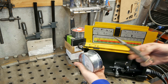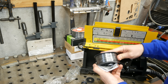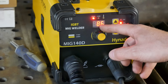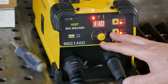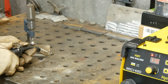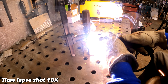First, we're going to start off with the Lincoln. It's in shrink wrap packaging. I found that this stuff is kind of glossy but it also has a little bit of a matte color to it. Loading this up, the welder is dual voltage and we're running on 240. This is your amp readout and it basically auto-sets your wire speed to your voltage — we're going to be running about 110 amps. The first tip with flux wire is that it's actually hollow, so you have to weld at a much slower travel speed than you would with solid wire and shielding gas. Watch your weld puddle closely and make sure you're adding enough wire to build up the weld properly.